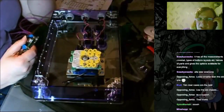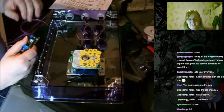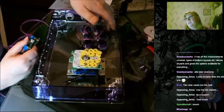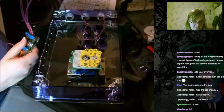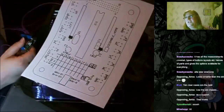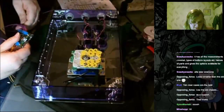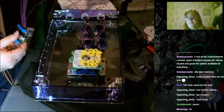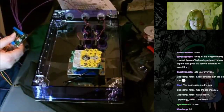Now you have to bear in mind that at the moment, from our perspective, these buttons are mirrored because it's upside down, so it's going to be low, medium, high punch and macro button on the end. So we need to wire them accordingly. And we need to use the reference chart in order to do that. So let's start with the punch buttons. Let me just untangle these a bit. It's always good to keep these relatively untangled while you're doing this, because it's going to make your life easy later on.